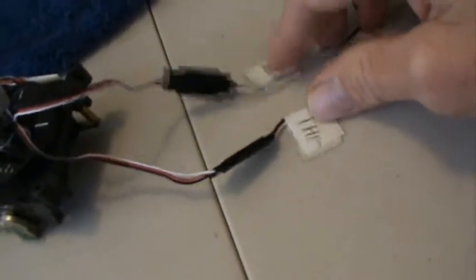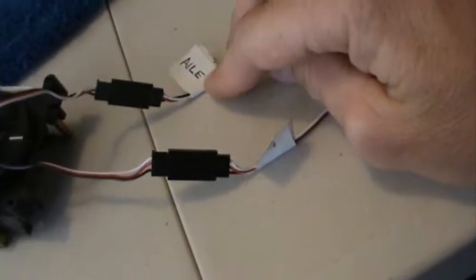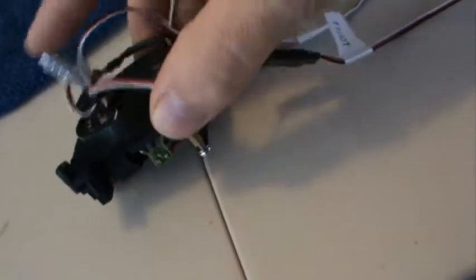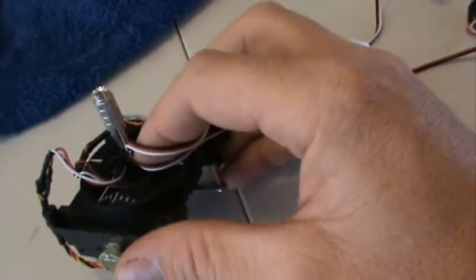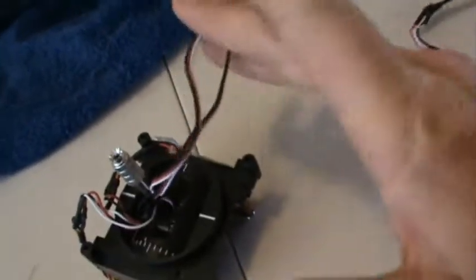Next, label the leads. This is a Mode 1 controller, so it's throttle and aileron. If it were a Mode 2 controller, this would be rudder instead of aileron. If you're not sure which lead is which, look at the pots — in this direction you've got throttle, and the lead coming out of that pot is for throttle; the lead coming out of the other pot is for your rudder or aileron depending on your mode. The only other thing to do at this stage is grab a small cable tie and attach the cables to the bottom of the stick, making sure that when you move the stick in all directions there's enough wire so it won't fail. Then you're ready for the next step.